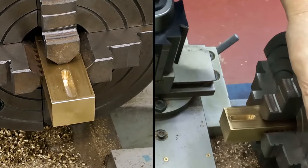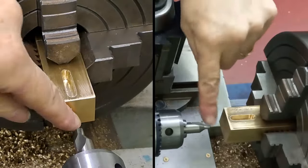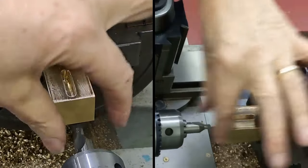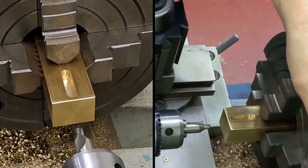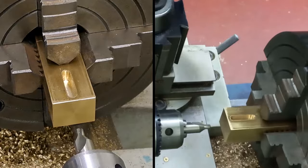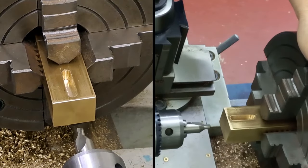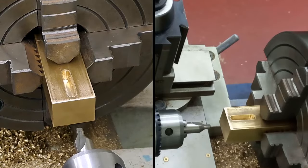I've got a center coming up. There we go. In the drill chuck, I'm going to put a reasonable center in here. Take the drill chuck out, take the center away. Put the live center back in, pull this all forward so we're clear of the scratch marks I made on the block in the beginning. And so I'll loosen two jaws up, and then I'll tighten two jaws up, those two up again, so roughly the same amount. And then we start re-indicating the little bit that's left in the chuck. So let's get this center put in and keep moving on.